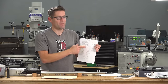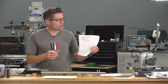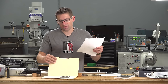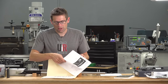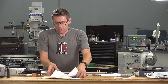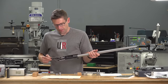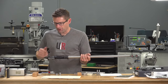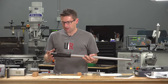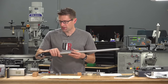There's no counterbore; the dimensions are right on the Kelbley's product page: one and one-sixteenth inch tenon diameter, 18 threads per inch. I also talked to the folks at Pierce Engineering — I'll be using their titanium action for a 65 PRC build and it's a similar situation. The Atlas Tactical action has a nitrited finish, super smooth, doesn't need lube. It's 416R stainless for the receiver and chromoly for the bolt, with an oversized tactical bolt handle, trigger hanger, and included pinned 20 MOA rail. A really nice setup.